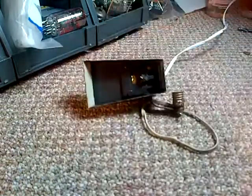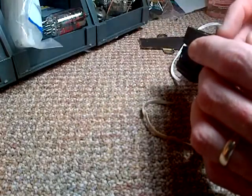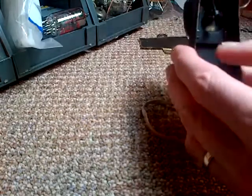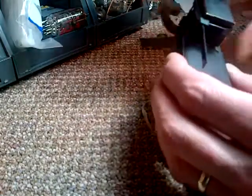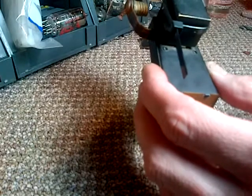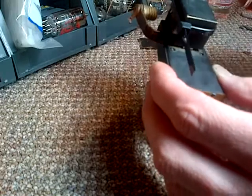So we'll take the bottom off. And there's the vane, right there. And the magnet — the horseshoe shaped piece. It's very hard to see in there. So it's held in with these two rivets, right there and right there. The best suggestion I got is to drill those guys out and later replace them with a brass nut and bolt, which is a good idea.